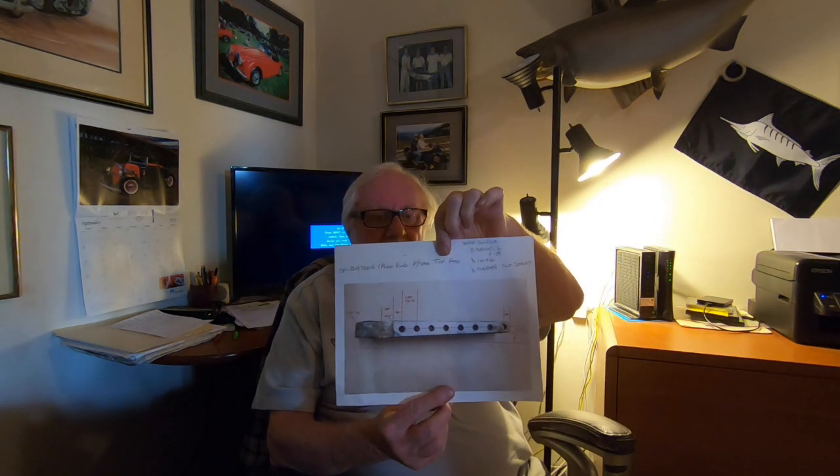The work that you've done on the wing pins, that's crucial. It's on hold, but that's using almost solely reverse engineering of surviving parts. Ian makes photographs, dimensions them all up, and we just make models of them. That produces a solid model from which you create DXF files, which create the programming to machine the parts. So even though they're not complete, we've got a working model that we can start plugging in as other parts become available.